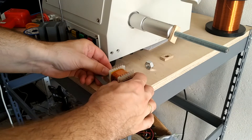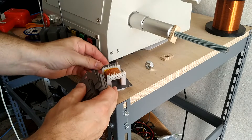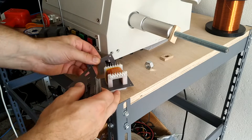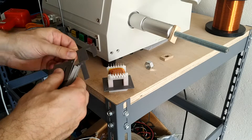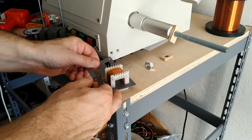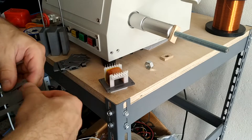Here I'm carefully separating the laminations. I'm using the interleaving system, not the butt-stack system. If we had DC in this transformer, we would have to use a gapped transformer where all the E and I laminations would be separated. But since we're using a para-feed system with a capacitor in series with the windings, we don't need to do that — we can just interleave them like we do for power transformers. It's a little tedious to put them all in carefully without mixing up the orientation.